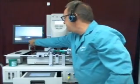We can see our solder balls down here in the video screen. Okay, we can see it's starting to come up to reflow temperature right now. And there we go — they're all reflowed. As you can see, the chip is starting to move down closer to the board.